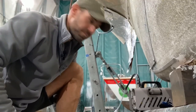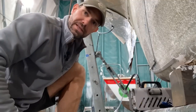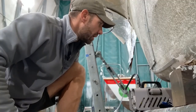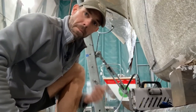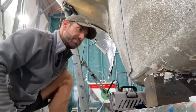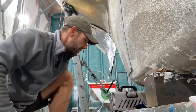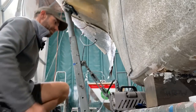because these are very, very small pumps, and I'm not convinced they're really designed for the kind of long-term use that I'm putting them to, but I decided it was better to have multiple small pumps than one big pump. The oil does pick up contaminants from the stuff that it's drawing out of the laminate, so I do have to change it because I think it damages the internals, but that's a fairly easy process.